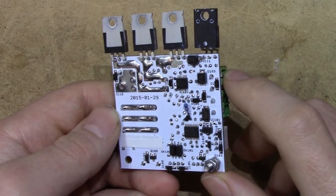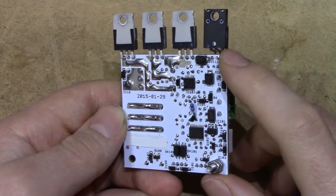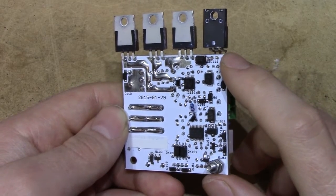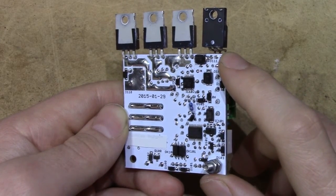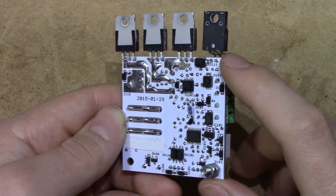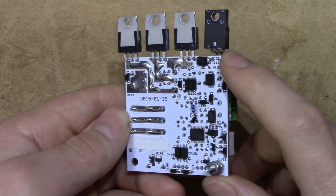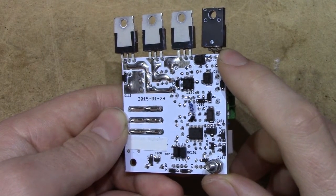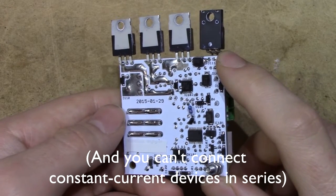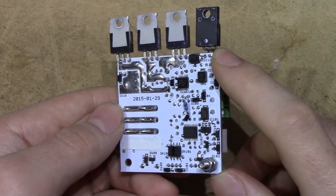This is in order to be able to test battery chains which are connected together. So if you have a 48-volt system, you can connect all four units in this box to one of the batteries without causing any explosions, because if all the grounds were the same — or all the positives were the same — you would be shorting out three of the batteries, which would just blow fuses and cause fires.